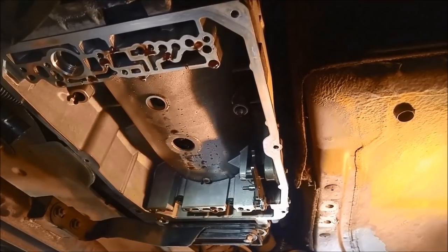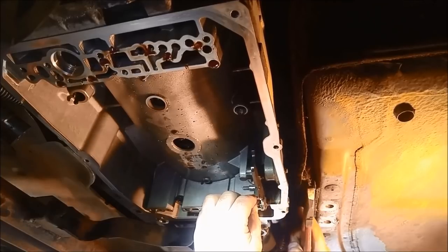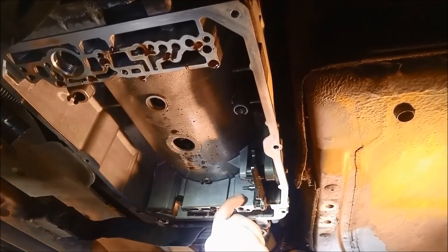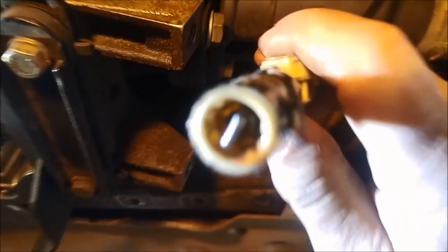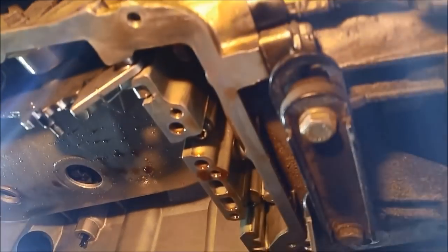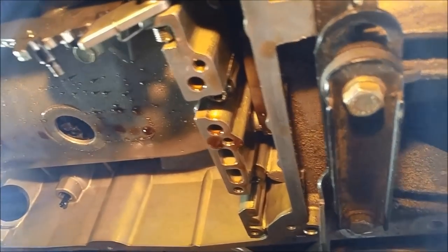That's just tapping on that o-ring now, so you don't want to force it too much. It's got to go in under its own pressure and its own time, otherwise you'll cut that seal. It looks like it's gone in — it was sticking out a little bit, but I've tapped it in all the way. You can see the spring pushing it up, and now we just put this cable in. It's got that little thing inside there that's supposed to locate in the slot. Put it in, push it in, there's a little tang where my thumb is that you line up, slide it in and just turn it clockwise and that just sort of locks it in place.